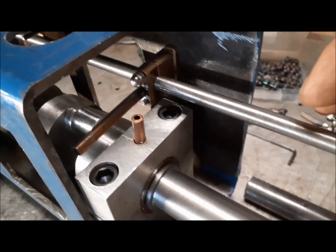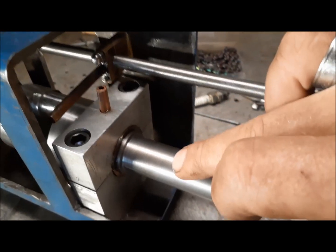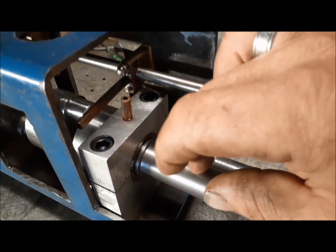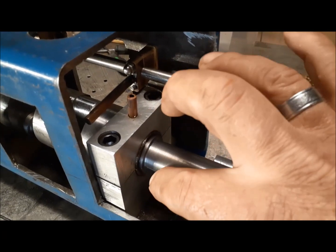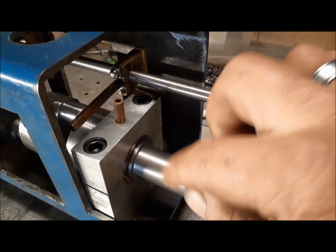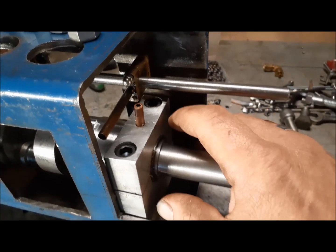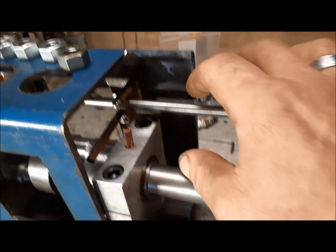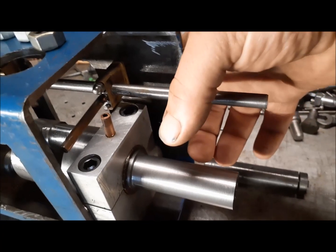Now the other problem I'm having is the location of the cam relative to the crank. I was originally going to do a timing chain, but for one thing, I can't find a 2-to-1 ratio of sprockets that will work on this shaft. The smallest sprocket they make is really big, and so the bigger the primary gear gets, the bigger this cam gear has to get. And there simply is not enough space.